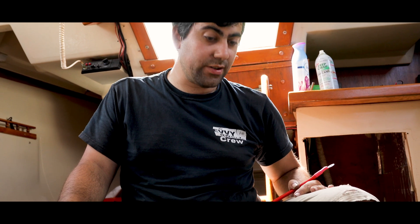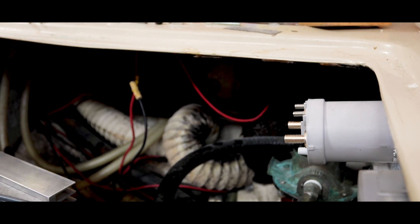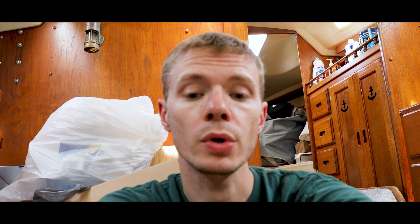I need to find a place to move the contactor coil, which is currently here. This cord that Nick is holding doesn't reach — it goes to this connector and then toward the middle, but no further. So we need to move it. Half our struggle is finding places for components and then having to move them because a cord is too short or something. Quite frankly, this boat was built with an engine in it — it was not built for things like this — so we have to be clever. Good thing Nick and I are smart as a duo.